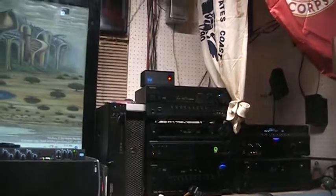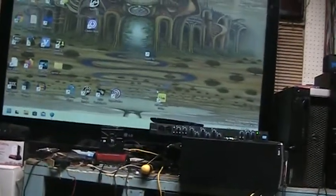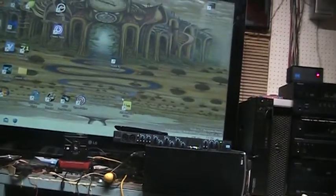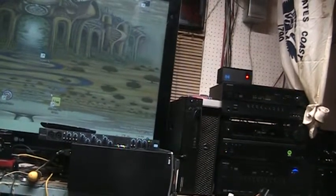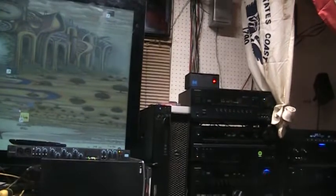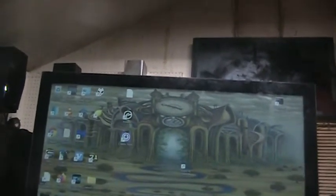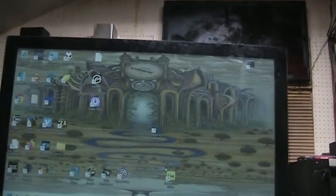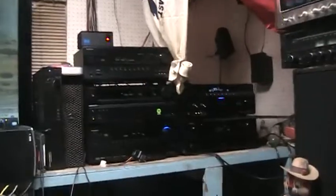That echo is most noticeable when you try to mix a 5.1 with anything higher, like a 7.1 or 9.2. The Sapphire is my pre-feeder, and it feeds out to SP/DIF dumping into the HDAV — that was the only way I could get the timing right. I'm carrying my timing on DTS because I don't want to deal with word clocks. I'm trying to keep this entire project simple enough that anyone could duplicate it. The algorithm will be on my SourceForge page eventually.